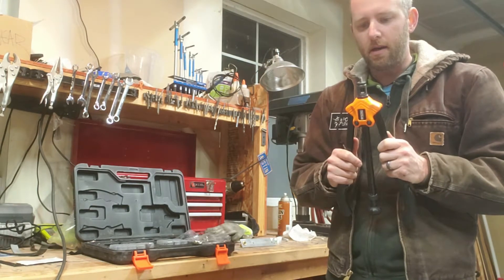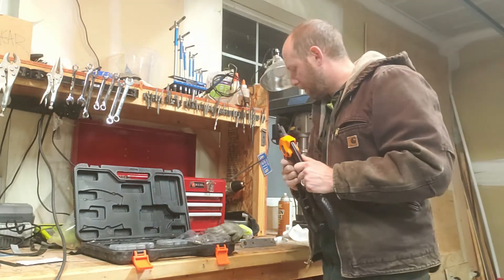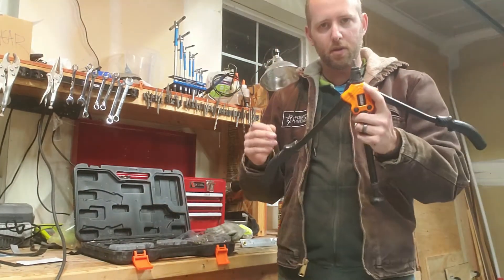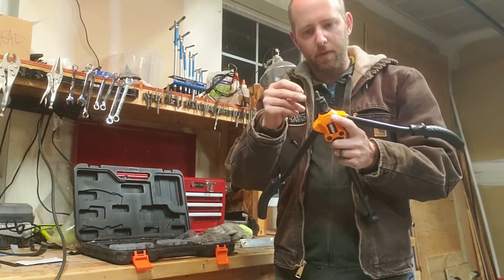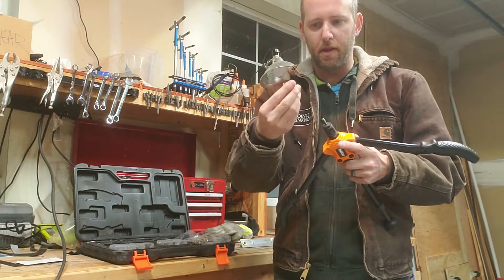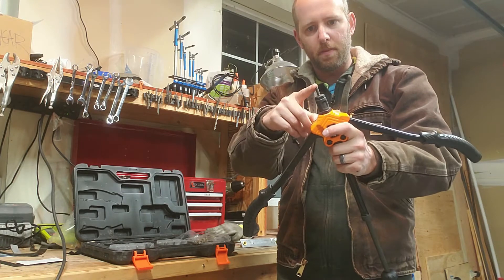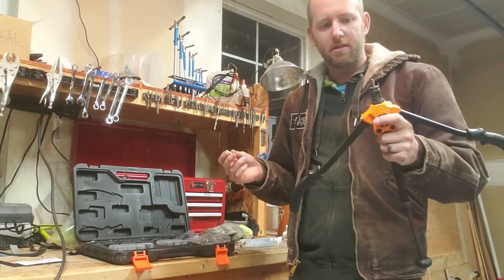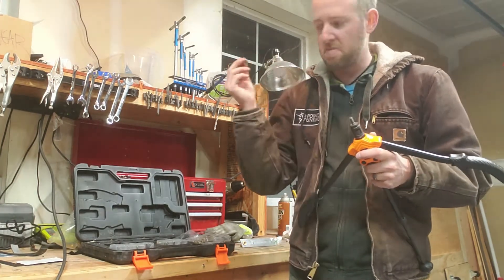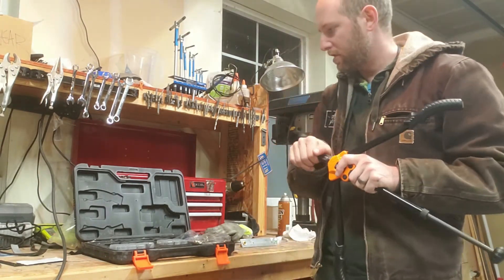Unfortunately, this unit — at least in the quarter-inch size, which is the only size I've tried to standardize around — does not work with PlusNuts, at least the PlusNuts that I've gotten. Here's the standard PlusNut and the quarter-inch mandrel. When I put it on there, I can spin and spin, but the barrel of the PlusNut is just too long to fit this short mandrel. I've sent email inquiries trying to get an answer on why they can't make a longer mandrel that works for PlusNuts, but I haven't been able to make that work. I did come up with my own custom solution that works pretty well.